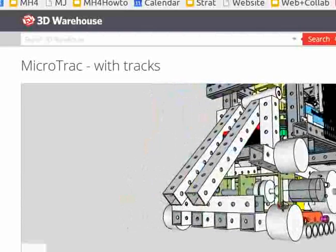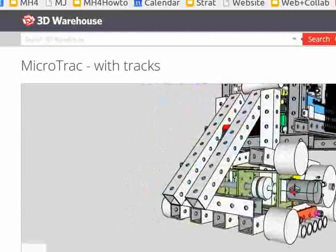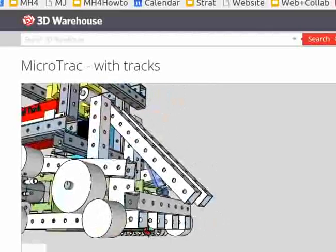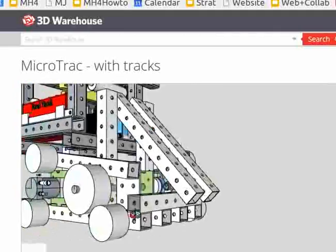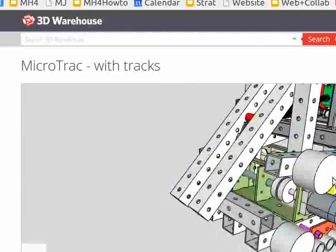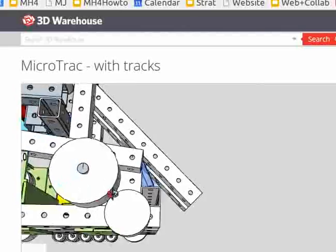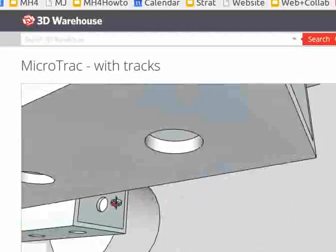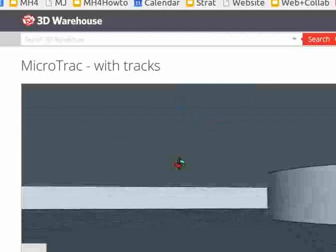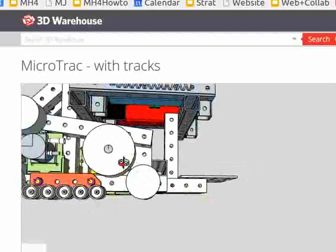They're both sitting above the motors. One concern is that you need to place it above the motor. The one that's facing up to the front is like that because you need to go over the motor mount. It's geometrically restricted by that. But if we raise them higher on each side, just for symmetry and ease of everything, would that hurt us any? So that they're both parallel to the ground? I mostly had that angle in there just because I was trying to use the 8x16 plate. I see, because of the 8x16 plate.